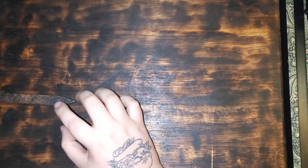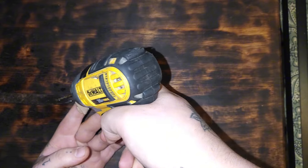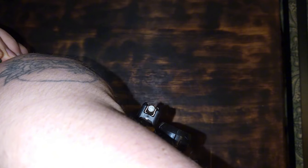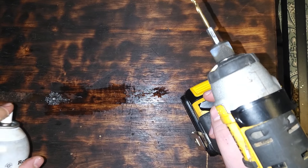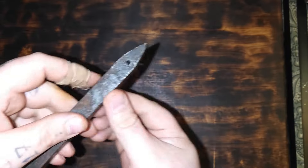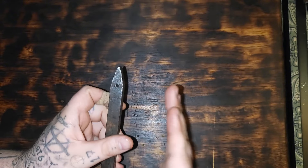I already got my little handle drawn out on this piece of wood, gonna be carving that out, burnishing and oiling it, and making a tiny little leather cover for it. Let's get to it. I just got this clamped down, we're gonna start with drilling this hole in case something happens, the metal cracks or anything. I'm gonna use some rim oil for lubrication to drill this hole, nice and slow with it. Already used my automatic center punch to get a little hole started so the drill bit won't walk.